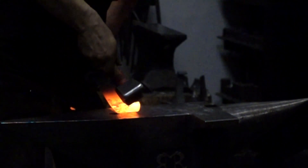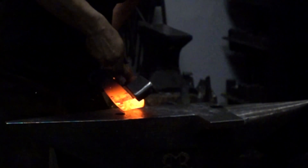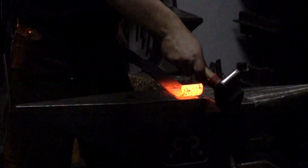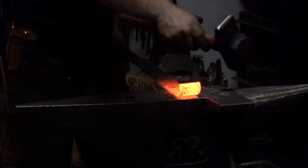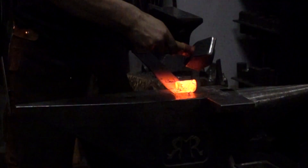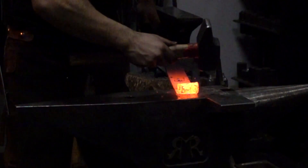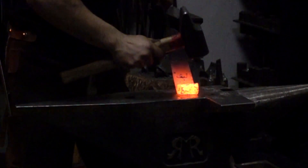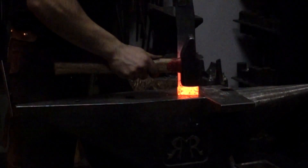Quite often with a cheaper knife you'll just see 'steel Damascus,' which tells you absolutely nothing unless you actually know which steels were combined. On the rare occasion you'll see something advertised as an etched pattern, where they'll put a negative image on it — much like vinyl decals on a car — using a corrosion-resistant paint, dip it in acid, and you have an affected and unaffected layer. It may not even be Damascus, though thankfully they don't usually call it that.